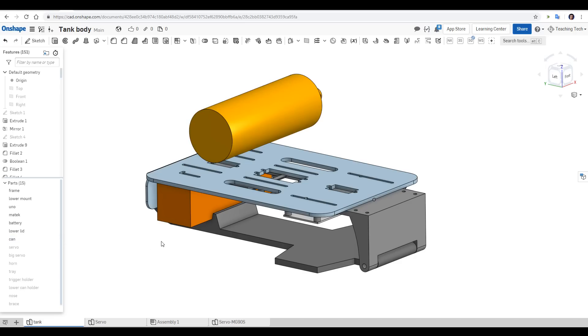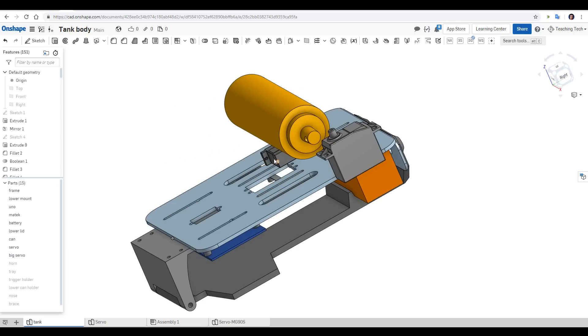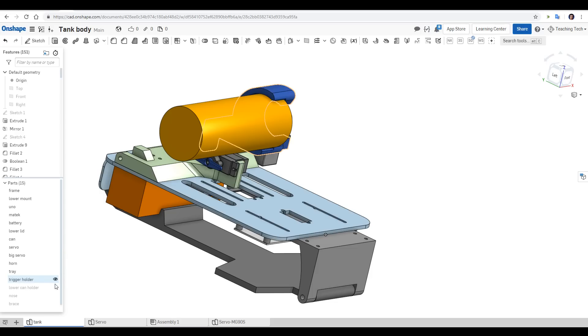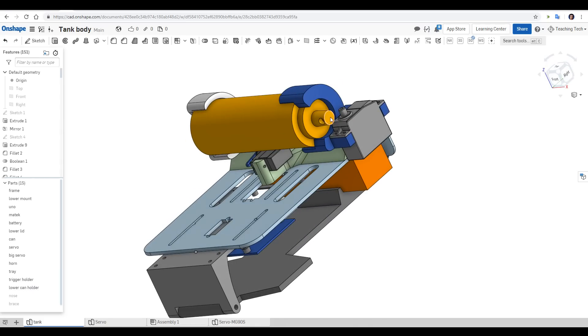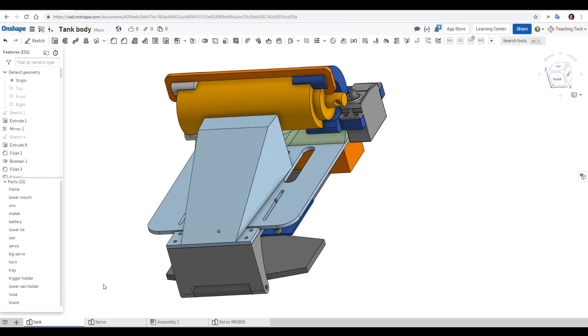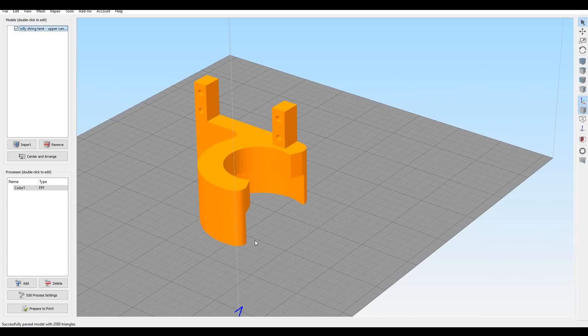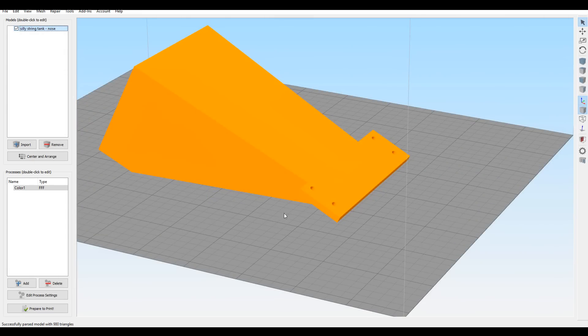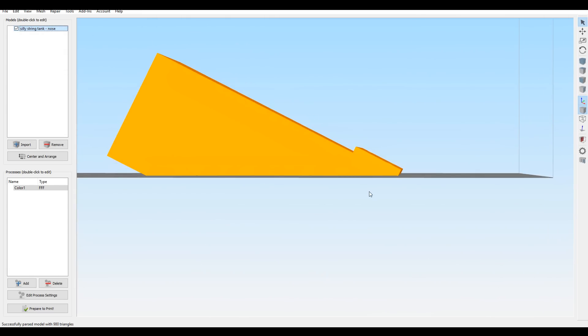The next thing I did was to model the can in the position where I wanted it to sit, and then I either modelled or imported the two servos required to get the trigger on top of the can, as well as the one to change the tilt. Little details like the horn were also important so I could get everything aligned. We have a tray piece which bolts onto the tank chassis, then I modelled two parts that snap onto the can — the top one also holding the servo, so a one-sided horn can push down and activate the nozzle. There was a tiny bit of effort to model up a nose, and then a brace which was required for it to function properly. All parts are oriented ready for printing and most just need high infill for strength but no support, apart from two: the upper can holder needs support from the build platform only underneath the rim, and you also need support from the build platform only underneath the nose to support the bolts for mounting. The nose part can have a much lower infill to save plastic, as it's purely cosmetic.